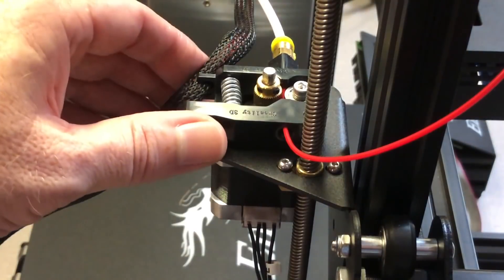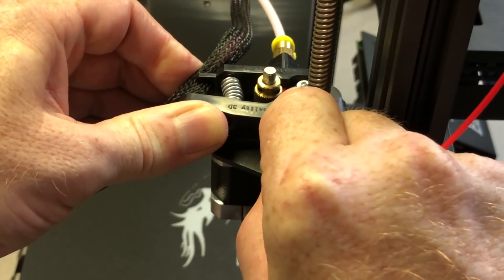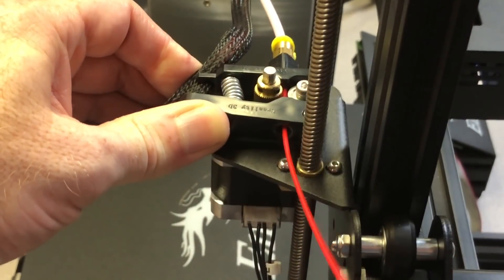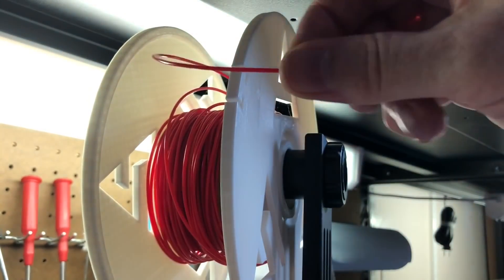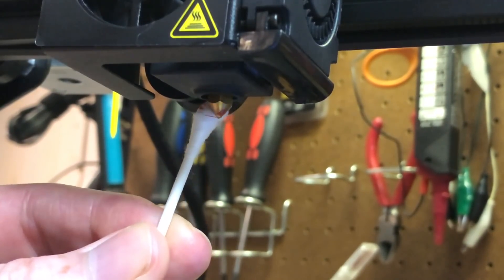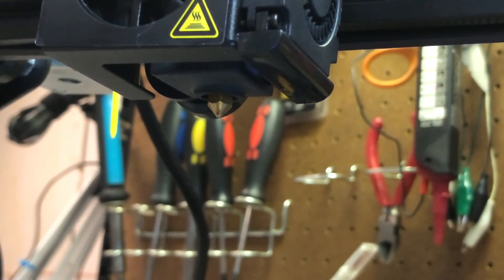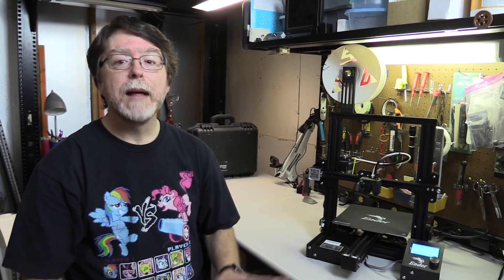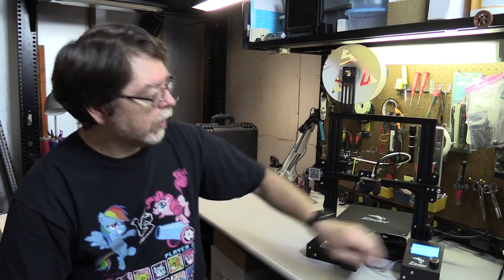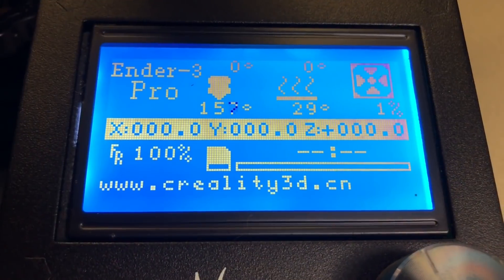Once the nozzle is up to temperature, press the filament loading lever in. Then push the filament into the extruder just a little bit to make sure there's some coming out of the nozzle, then pull the filament entirely out. Secure the end of the filament so it doesn't unwind and get tangled on the spool. While it's still hot, use a cotton swab to clean the nozzle and get stray bits of melted filament and gunk off of it. If you have a wire brush, you could use that too. Then we'll turn the printer off and back on again — because when it's on, the hot end cooling fan is on, and that'll help cool the nozzle down faster. Now we'll wait a few minutes while the printer cools down.